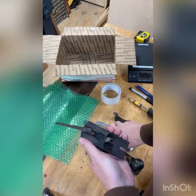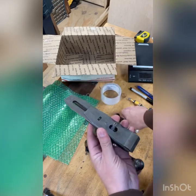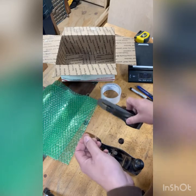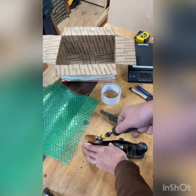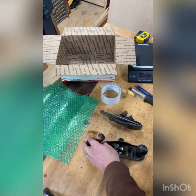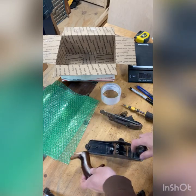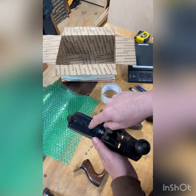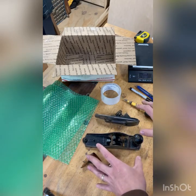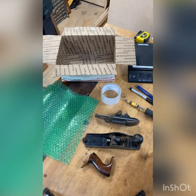Take that frog and iron — leave it all together, you don't need to separate the iron from the chip breaker, also known as a cap iron — and temporarily install those back together as one unit convenient for shipping. For the rear handle or tote, go ahead and remove it. On a number three or four it'll just have the main tote screw; a five and up will also have a forward tote screw. Leave the front knob on — there's really no reason to remove that.